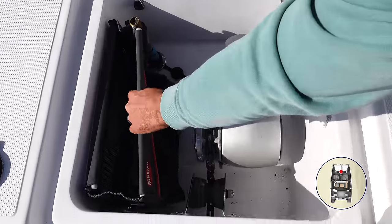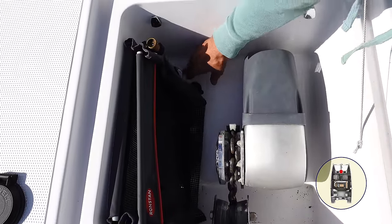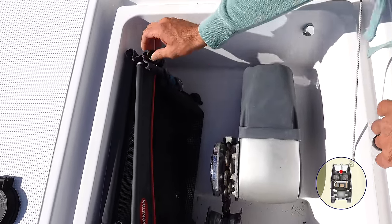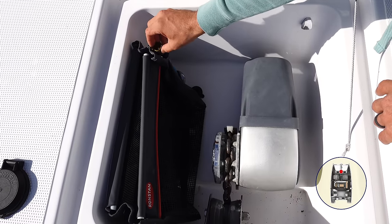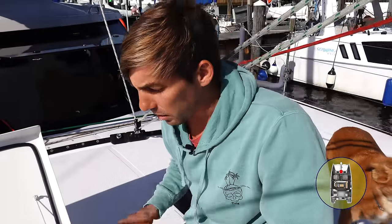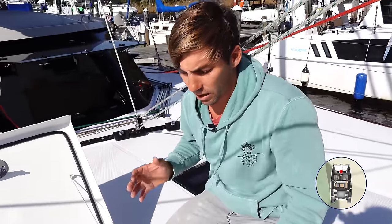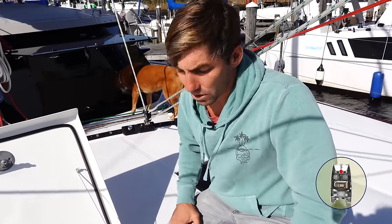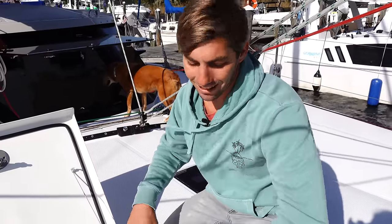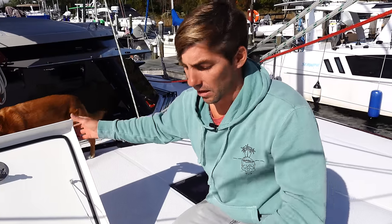We made a few tweaks in this area. I have a Ronstan pouch that keeps a hose in, and I modified the Quick Connect freshwater fitting to be almost always connected here as a freshwater rinse. We have plenty of freshwater aboard, plus a high-output Rain Man water maker. The idea is rinsing down the chain preserves its life. The chain lives wet in its wet locker and chain locker, but it's all freshwater, so hopefully it lasts a bit longer than if it were saltwater.